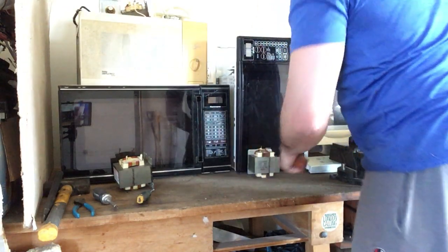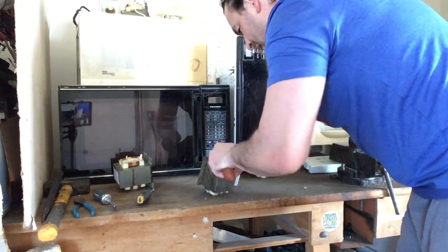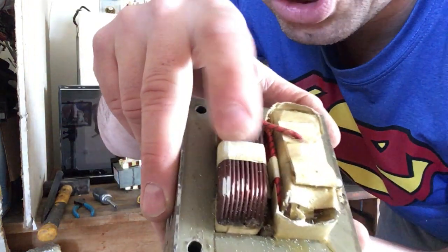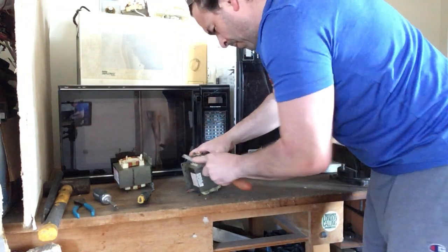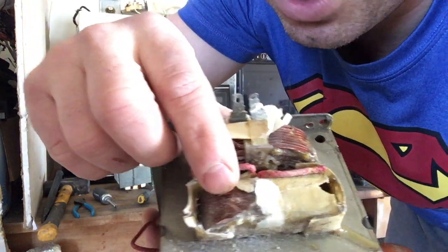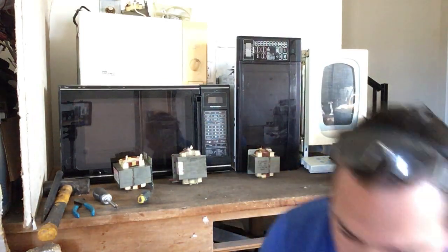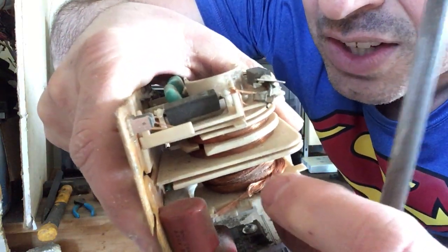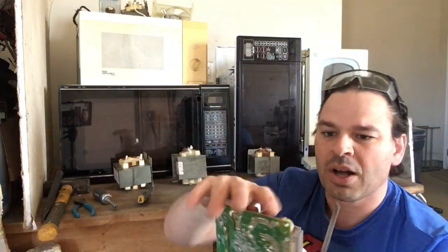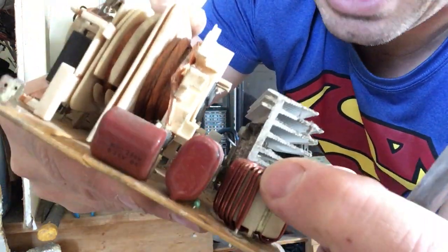My last one, the 2005 model. Checking the first winding — I have aluminum on that side. But I want to make sure I check both sides. That one is copper. So even if one side is copper, I'm going to get that copper out for sure. My inverter — I do want to make sure I scratch that as well. You can see right there, there is copper in the inverter too. It has a nice ribbon of copper, as well as what I call copper donuts — scratching confirms those are copper as well.